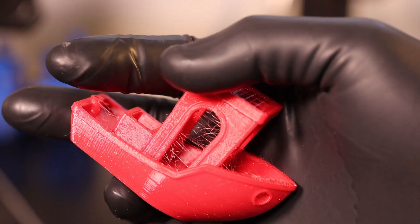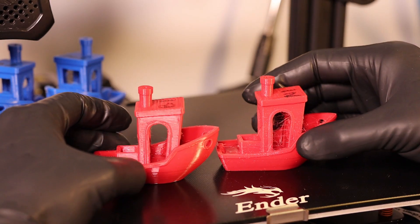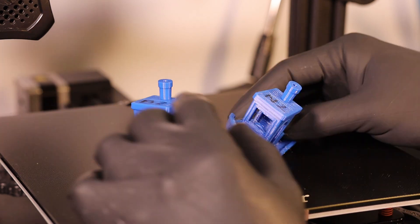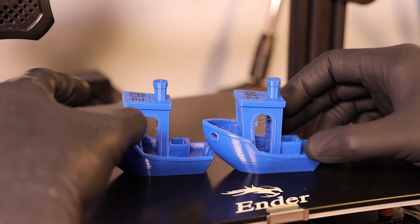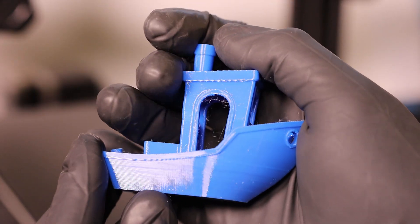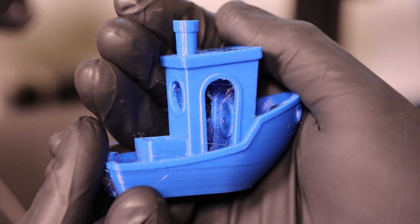The tiny bubbles are an indication of too much moisture in the filament. Although I like PETG for bed adhesion and minimal warpage, the downside is that it needs to be kept really dry — otherwise you'll see surface bubbles, more stringing, and more blobbing. The blue samples were taken from the same spool of filament and we can still see more stringing and blobbing on my printer compared to the Banggood printer. Looking beyond that, the surface finish is good on both, though there is a very repetitive pattern visible on both prints, more so on my printer.